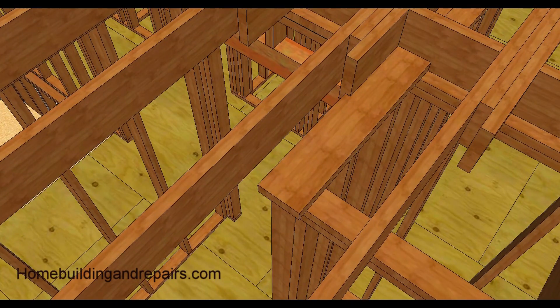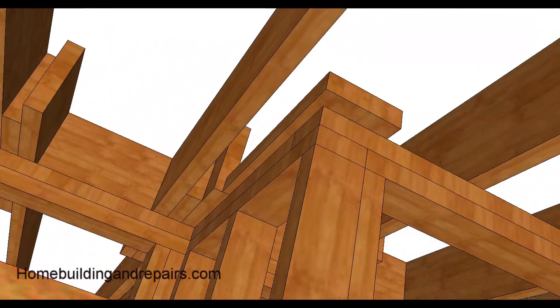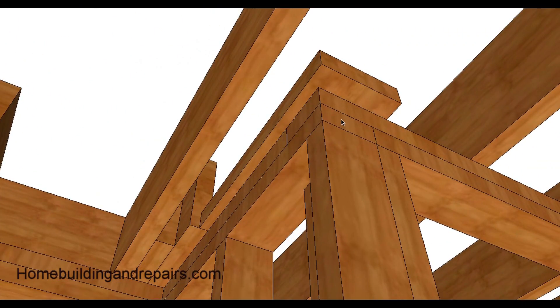Zooming in, take a look at the bottom — it's not a bad idea when you put backing to make sure that you extend it past a little bit. I've seen people just run a block across without any backing because that's enough for them to hold the drywall up. Keep in mind that when drywalling, the board on the wall shoves up tight against the drywall on the ceiling, and that helps support it also.